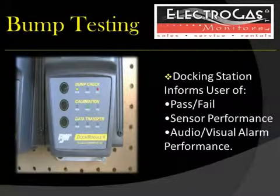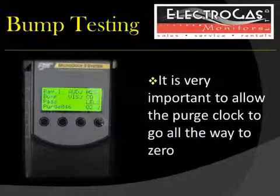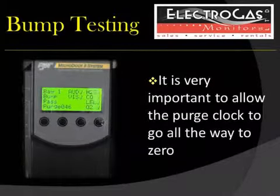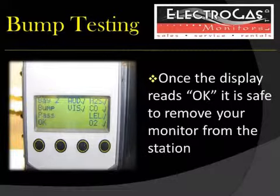The docking station will inform you whether your monitor passes or fails, while the display shows sensor performance and audio-visual alarm performance. After the process is complete, it is very important to allow the purge clock to reach 0. Once the purge cycle has ended, the docking station will read OK, and it is now safe to remove your monitor.